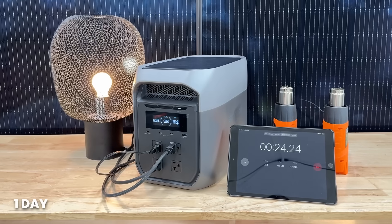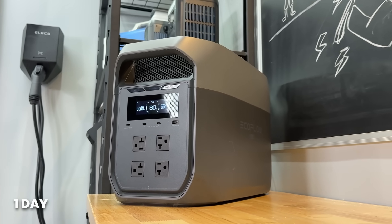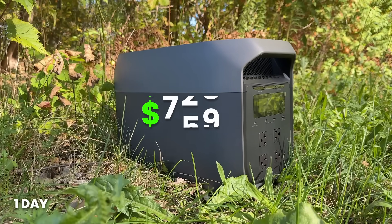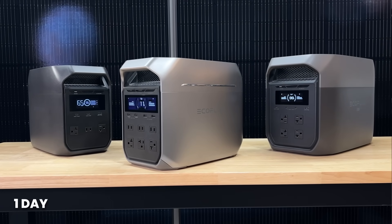For a name-brand option for one day, we'd recommend the EcoFlow Delta III Max. It has a 2,400-watt inverter and a 2,048 watt-hour battery. The idle consumption is a bit higher at 27 watts per hour — about 648 watt-hours over a full day. Your 1,300 watt-hours for the fridge plus 648 comes to about 1,948, so you just barely make it through one day. With our code it costs about $720. It's a little more expensive and leaves less buffer, so in this case we'd lean toward the Pekron. EcoFlow is a trusted name brand with a nicer design, but either way you'll be fine — the EcoFlow option is just a bit tight.